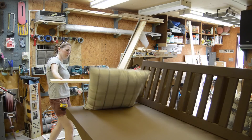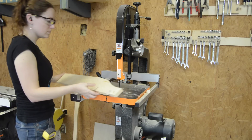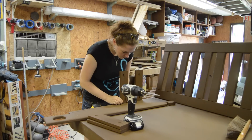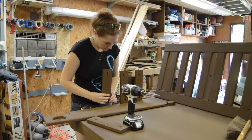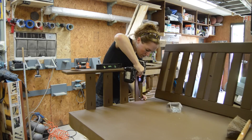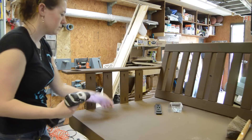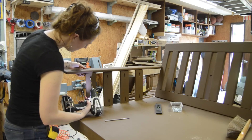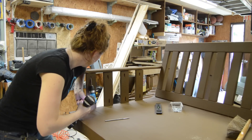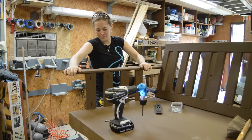For the last part of the body, I worked out the arm design — sketching something simple, cutting it out on the bandsaw, and using a jigsaw to cut out a cup holder. I cut more slots, gave everything a quick coat of paint, and started putting it all together. I used a pocket hole on the underside of the arm to attach it to the back, then used pocket holes to drill down the slots. When I ran into a space issue drilling the top pockets, a right-angle attachment sent by a UK viewer came in very handy.